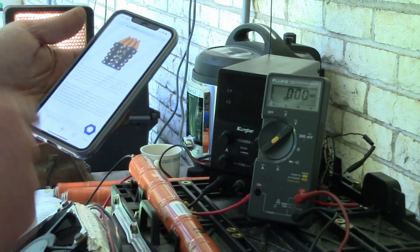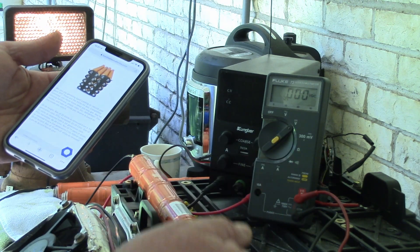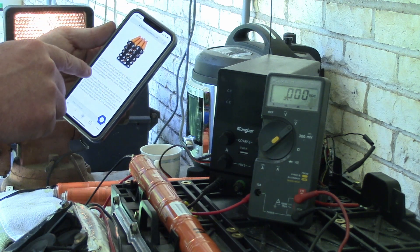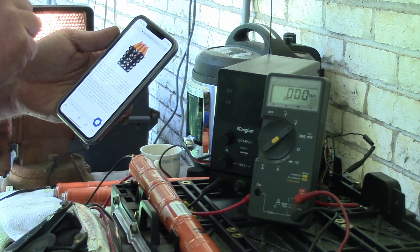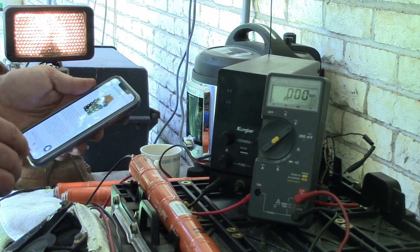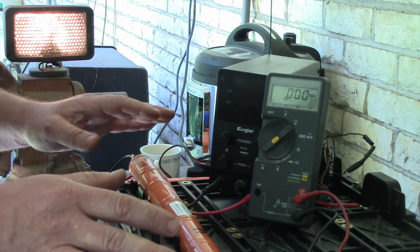So what I'm going to do is go through my pack, figure out which sticks are functioning fairly well, get them charged, load test them, check the voltage, see if there's any bad cells in them. And then when these sticks come in, I'm going to do the same for them. And I'm going to pick my best 20 and build a pack out of the best 20 sticks out of the 40 sticks total that I'll have to work with. And I think that will give me a pretty good chance at doing this DIY battery pack build.